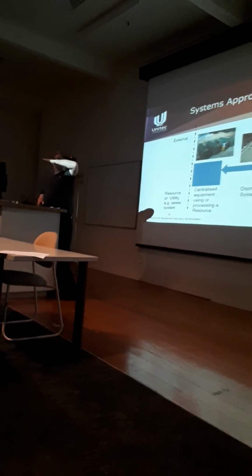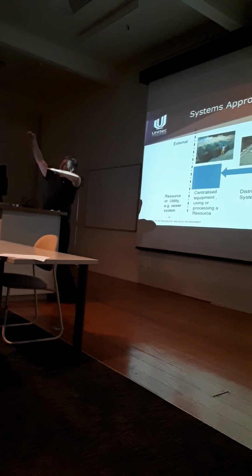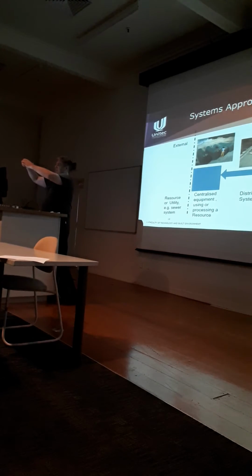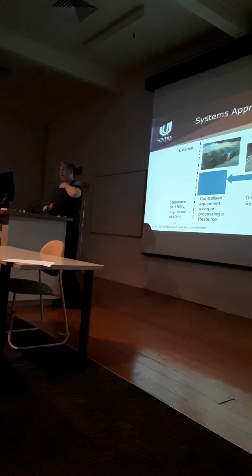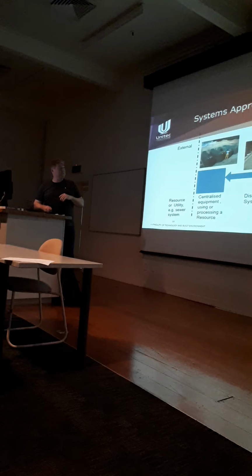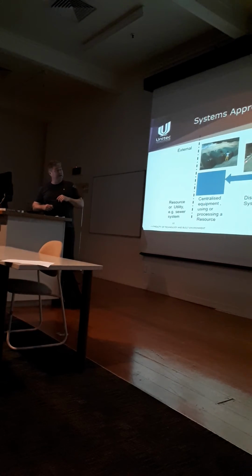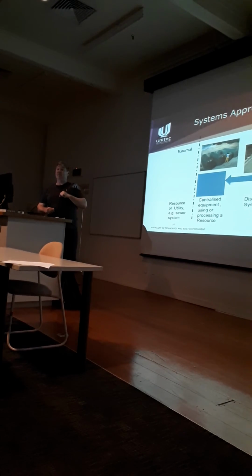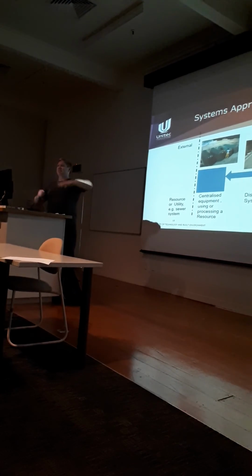And the reason for that is they can lay that flatter, and what they'll do is put a little reducer so the pipe comes out of the basin at 40 mil, and then there's a little cap that steps it up to 100 mil, and it will disappear into the slab. And again, you can lay that flatter. So if you're in a slab, and you have to reach a certain gradient, and that's the exit point, and the gradient says it's got to be 1 in 20, something might be popping out of the slab before you get to that point. So you need to know the distance and the gradients.